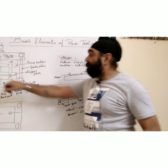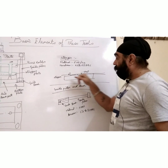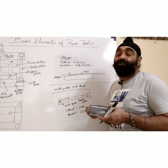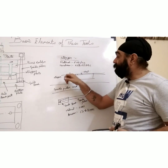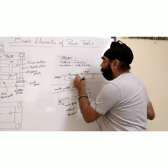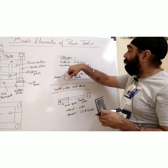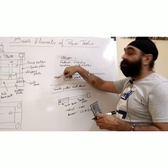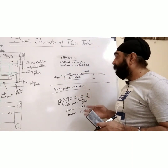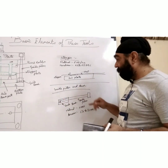The stopper is an element which stops the strip. Whenever a strip is fed, you need a reference point where the operator can stop the strip. The stopper is fitted onto the die plate — it is basically a small pin of diameter 6 to 10 mm. The material used for the stopper is EN31 or EN24, with hardness 52–55 HRC. You can use one or two stoppers according to the width of the strip.